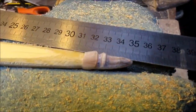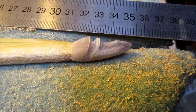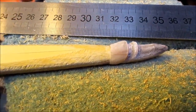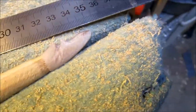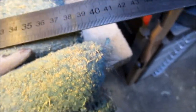I've got the horn nocks done — they're not polished up yet and the final fitting is not done because I blend them in to suit how the string sits on the actual bow. One of my pet hates is where people cut a groove for the string to sit in, because what they miss out on is the fact that the string moves as the bow is drawn.